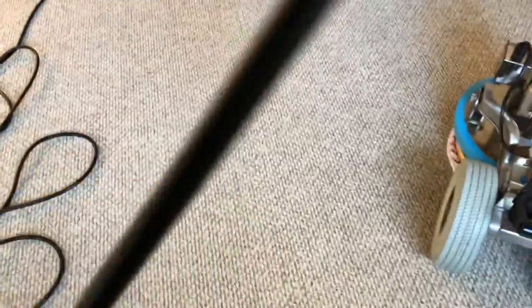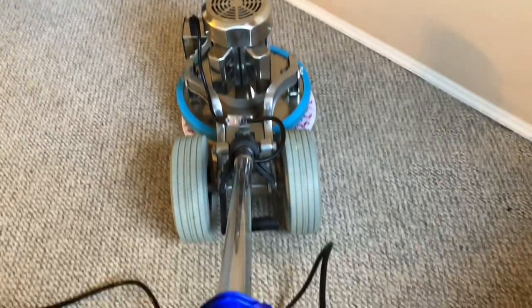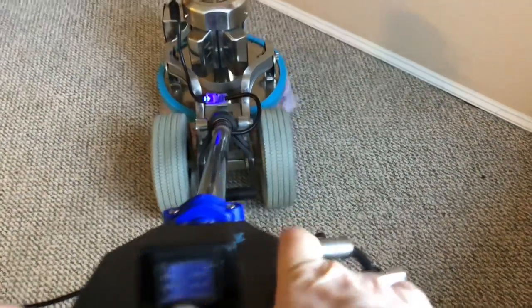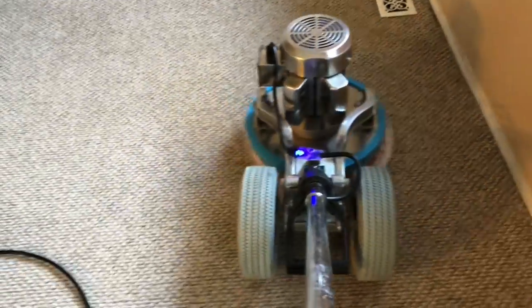So that being said, that's why when I get the Works sprayer, I'll demonstrate that for you. Obviously, you don't want to be too afraid that you're going to over wet the carpets, because you got to remember, if you're using the proper mist or the proper tip like the 8002 I'm using, you can tell by looking at the actual level in the pump-up sprayer as you go along. So I know that I'm probably getting a good gallon down out of the 2 gallons in the sprayer. I'll use about half of that sprayer down here in the living room, dining room, and the hall area.